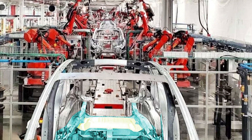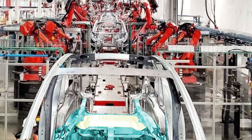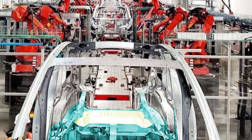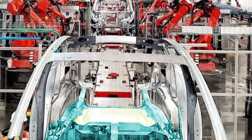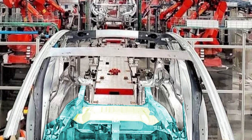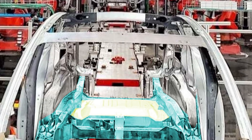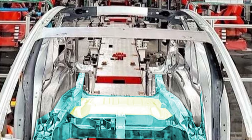They don't have to be added to a pressing as a series of further operations. We can also look at this casting from the front of the vehicle to see how much has been integrated here. The casting has forward projections to support the sills, vertical projections to support the side panels, as well as projections to the rear on each side.